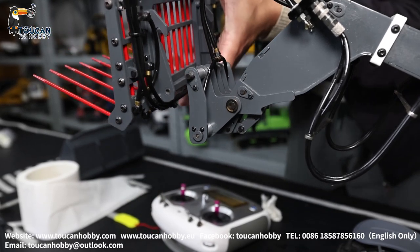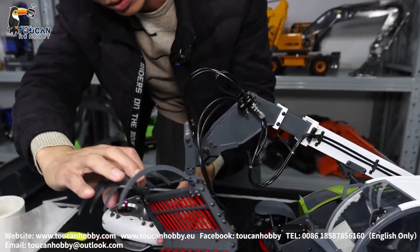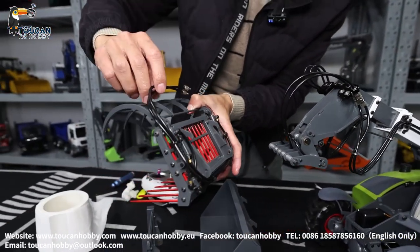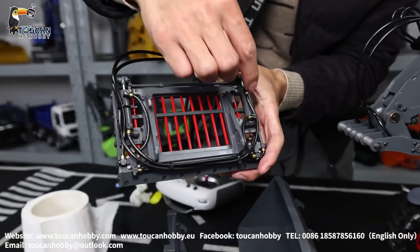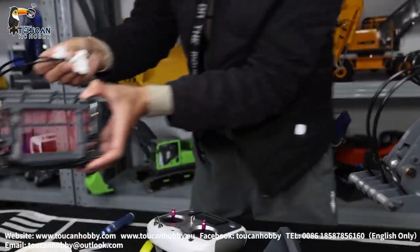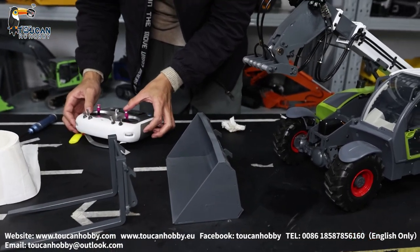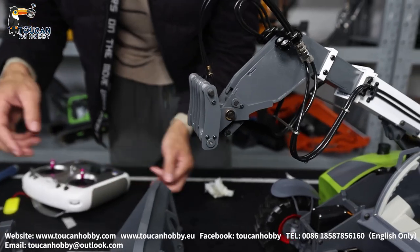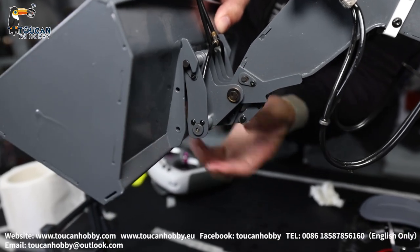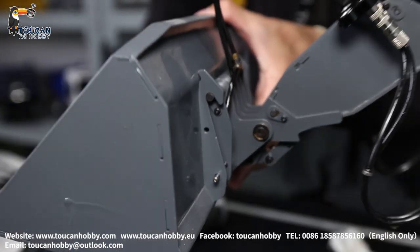That's the controlling. So for taking this out, there is a small screw that needs to be removed. After loosening these two screws, you can pull out this quick connection. So here you see it is opened and closed by these two small cylinders. When you move the cylinder, some oil still comes out. We leave it alone. We will change to this bucket, start the pump, change the angle. Now you can hook it up. Then here the pin, align it to the hole. Okay, now it is locked.